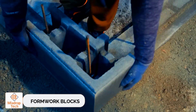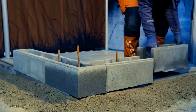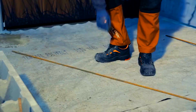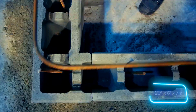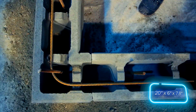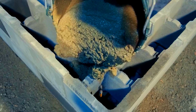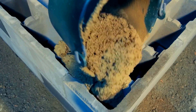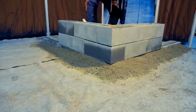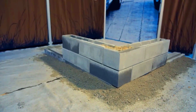Formwork blocks. Emblock timber offers panels as well. On the Building Material Corporation Trading website you can find classic formwork blocks made of concrete that are great for load-bearing walls in agricultural and industrial buildings. The design allows for both vertical and horizontal reinforcement. The smallest block measures 50 by 15 by 20 centimeters and weighs about 19 kilograms. The video clearly demonstrates the fundamental principles of installing these blocks.